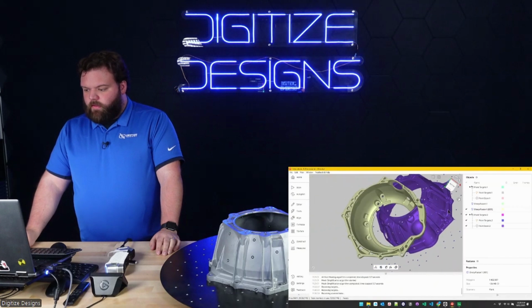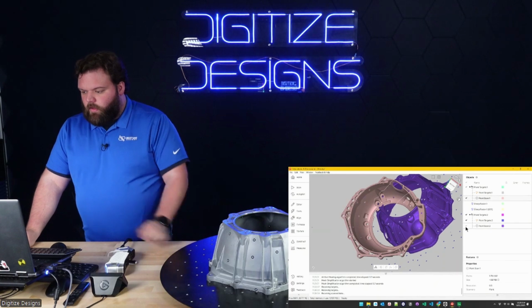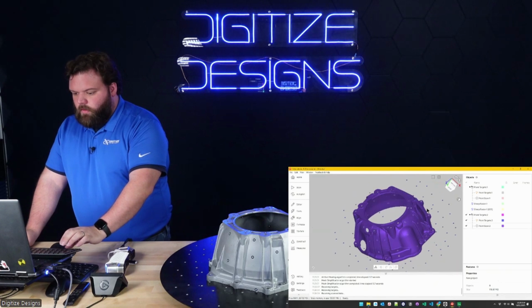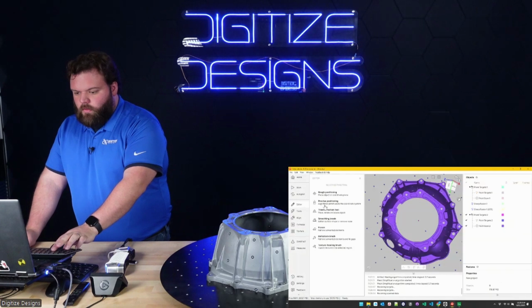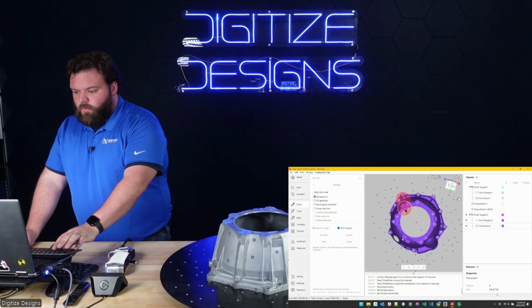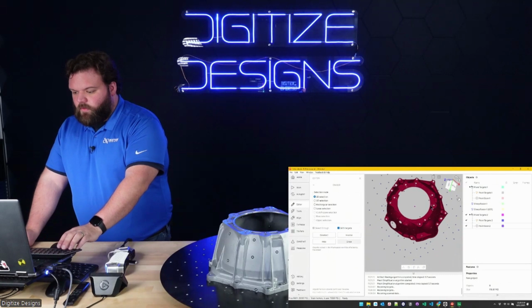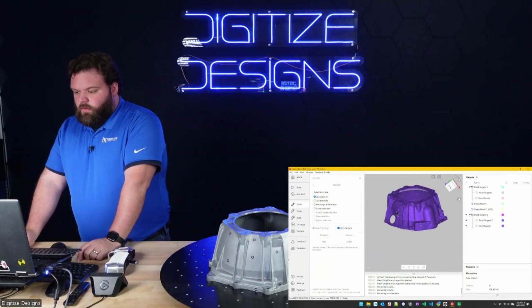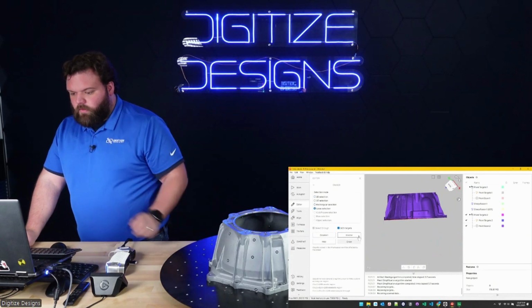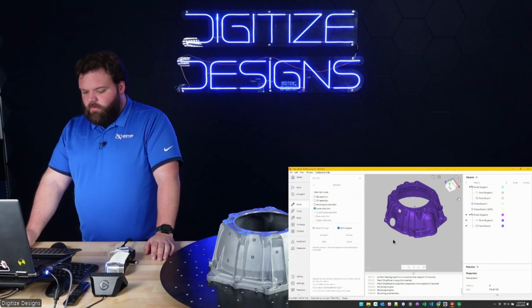So here we go. I've got these two scans now, and I'm just going to grab each one. Grab my eraser, and the thing I've got to do here to make the targets alignment work well, since I'm using a turntable, is I've got to delete the turntable targets out of at least one of these two, or it might use those for the alignment. So I just selected what I wanted to keep with my paintbrush selection there, and then we inverted that selection, and then deleted everything else.